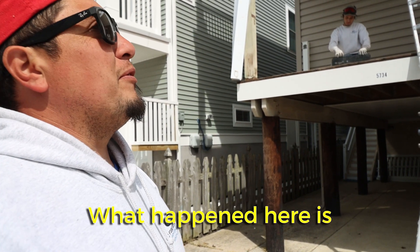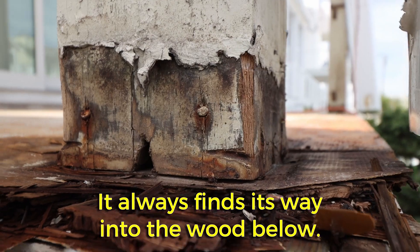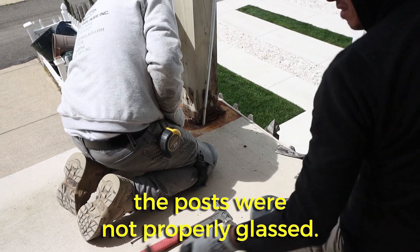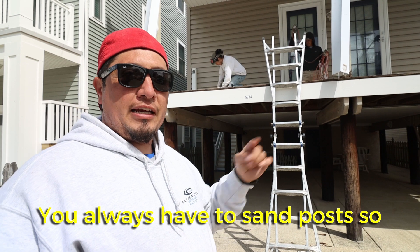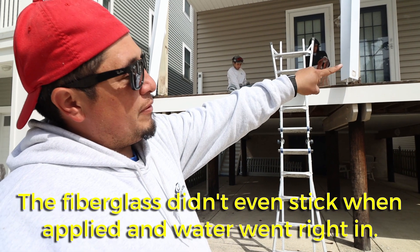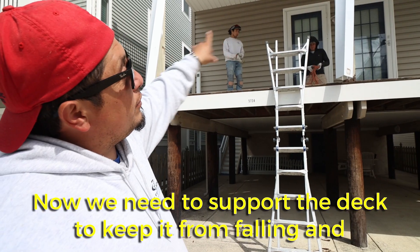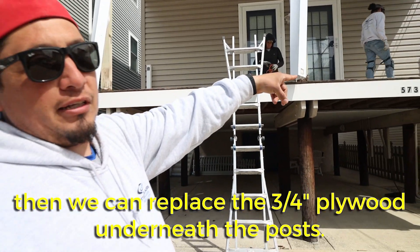What happened is the water got in. The water always finds a way in when the fiber is not well done — it always finds a way into the wood and damages everything. The columns are not well wrapped. They didn't properly apply the fiber to the columns. You always have to smear it on so that the fiber adheres and there are no leaks. What happened here was the fiber was stuck improperly and there were leaks. Now it has damaged three-fourths of the bottom and the columns as well. We have to redo all the columns so they don't fall.